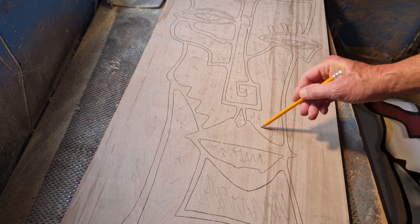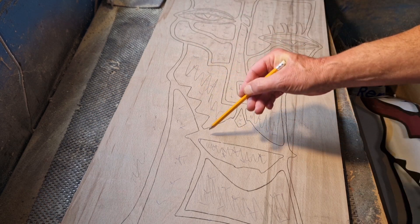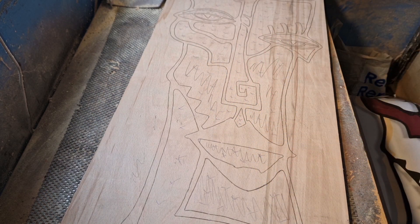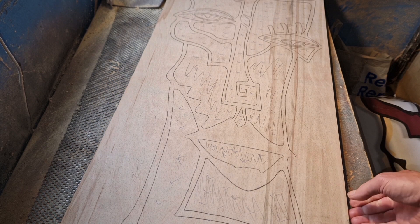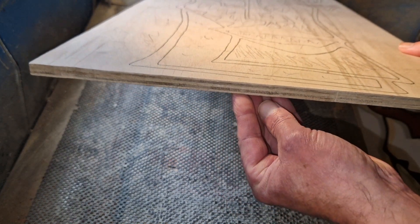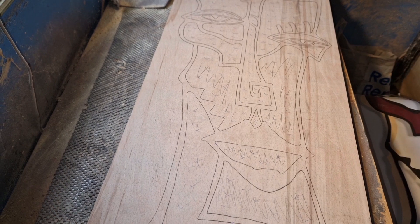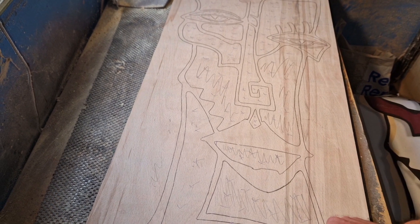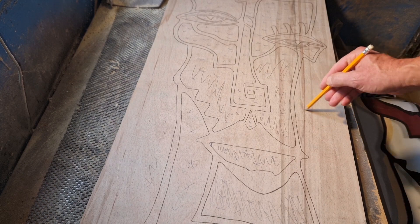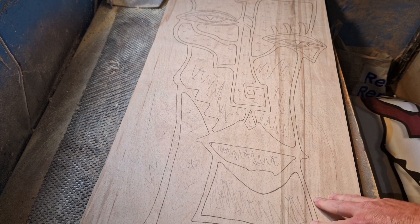Try shading the areas that you want to remove — or the areas you want to keep — so you don't go away, come back and start routing the wrong section. It's quite a big project and it's actually on 12mm plywood. I would have preferred a nice bit of pine but I just don't have any wood at this size, so plywood is going to be fine. Once it's all routed out, we'll cut it out on a scroll saw and remove all the outer section.